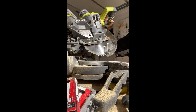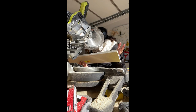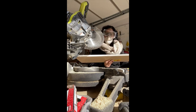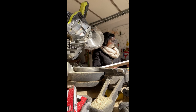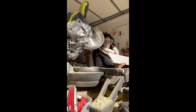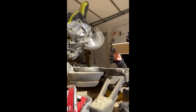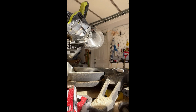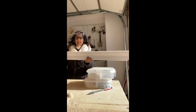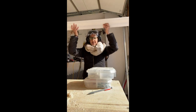I didn't do this, but I wish I had: I wish I got a couple of extra feet of crown molding and made some practice cuts so I could match up the pieces and visualize which way to cut them. Because as you can see, I'm really confused trying to visualize this and I'm not quite sure if I got it right. Always make a few practice cuts and have some scrap wood. So this is how the crown molding goes up against the PAX wardrobe — and now I have to cut that small side piece as well.